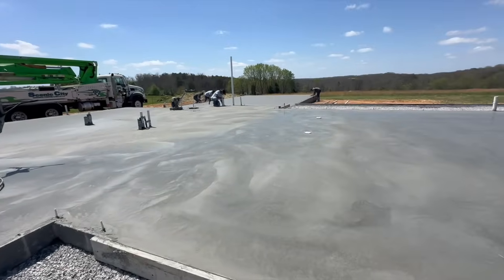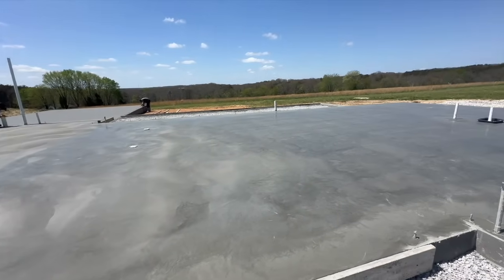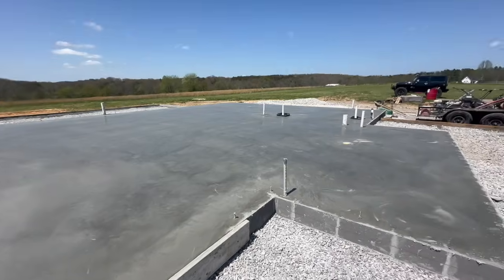So I was out there all day long, the minute it dried up, I'd be sitting there spraying it down. Once it got dark, it wasn't as bad because the temperature drops. But the fact that I was spraying water all day, it turned out great. Again, I don't know if you have to do that. We did. They recommended it, so that's what we did. It ended up turning out just beautiful and soft, and so smooth. We were so excited at how it looked at the end of the day, because from how it started to how it ended, that slab looks amazing.